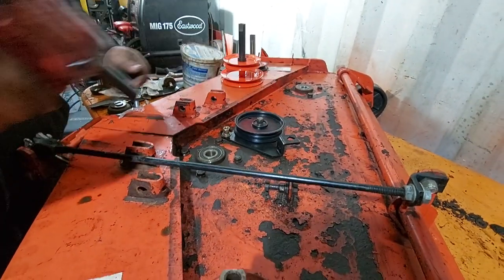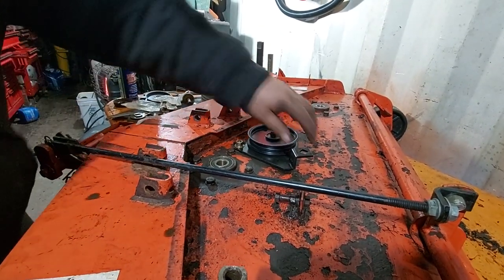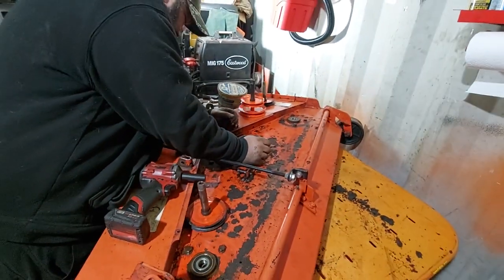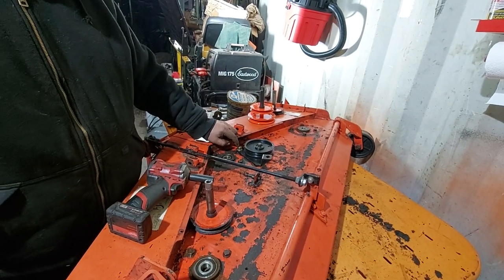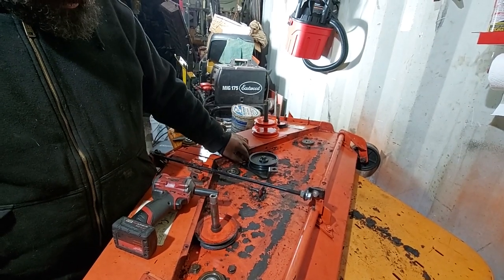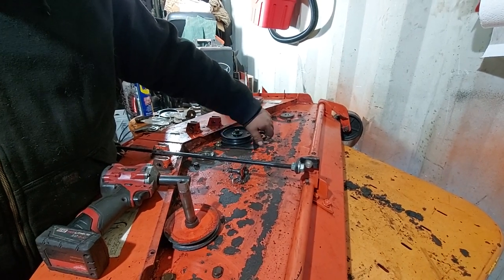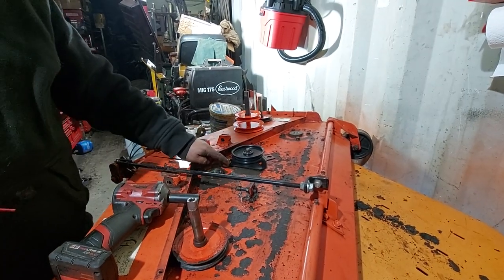You want tension on here but you don't need to sock it right up — everything in there has the spacer acting like a bearing. You want it so you can still pivot freely as you tighten it. That little bit is actually almost a little too tight — this has to pivot. Work it back and forth and it'll loosen up enough. You can also use a nylon lock nut here. You see there's no play in this like the original one had — you can move it with one finger but it has a little resistance. That's kind of what you want. Put a little grease on the washer up here.